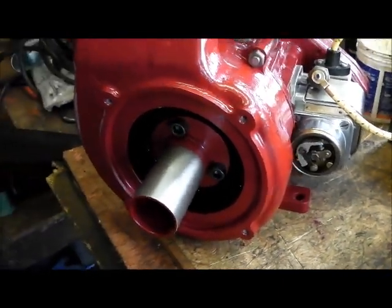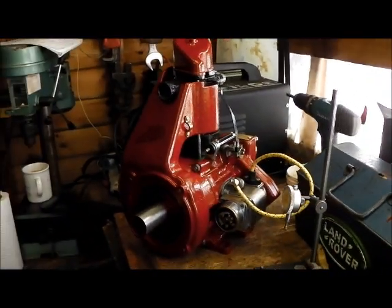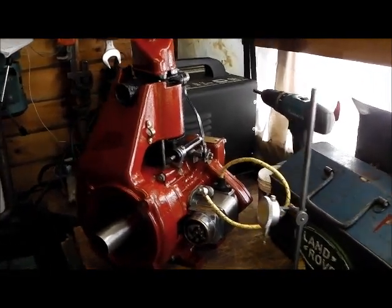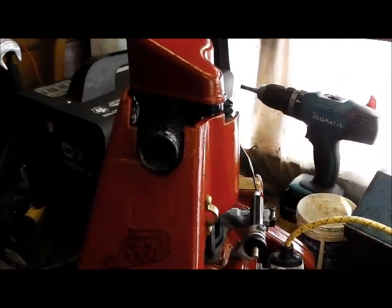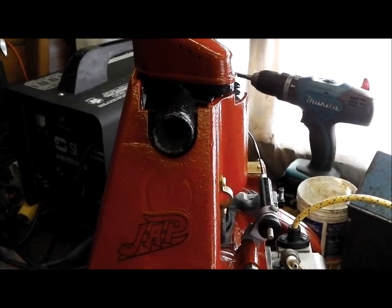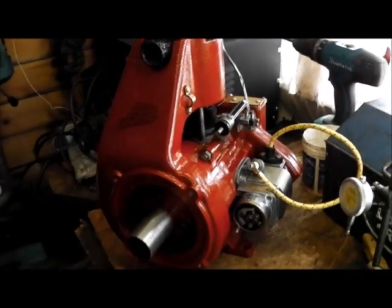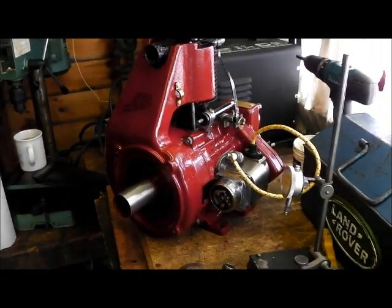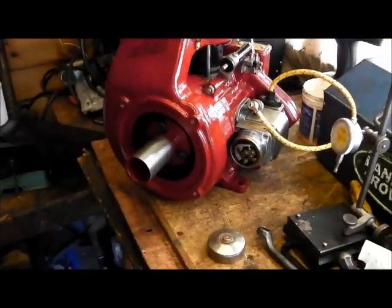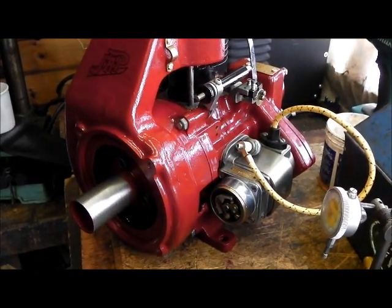Very happy with that. There is slight runout - I've checked it with the DTI but it's really not bad at all. Certainly very pleased with how the engine's going to look. It's just loosely assembled, no piston rings in there yet, I've got to get a set. I might add the piston and rings are exactly the same as those from the JAP2A - this is an Arthur Lyon design, so JAP saved on costs by using some of their own parts, which makes sense. It will make it easier for me to find a set of rings for it - should be a standard size I would think.